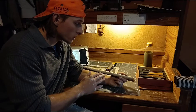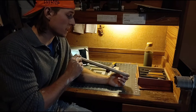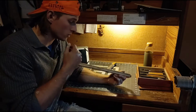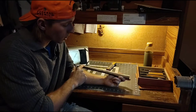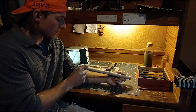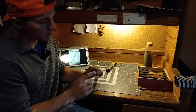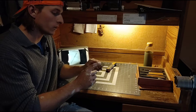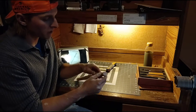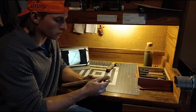We're going to be using hazelwood and I collected this hazelwood about two and a half weeks ago and it's been curing since then — drying out. You'll notice I only took the bark away from one half of it and left the other half on, and I also glued the ends down. You can see it did get a little bit of checking right here where it split, but I think I'll be able to make that the tip of the wand and carve it down smooth.